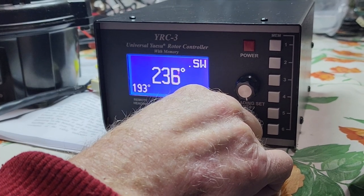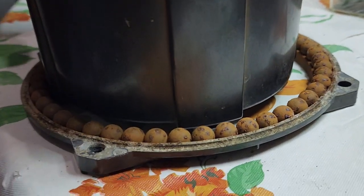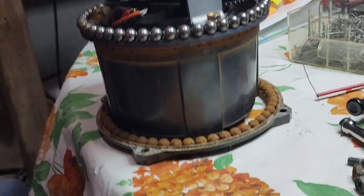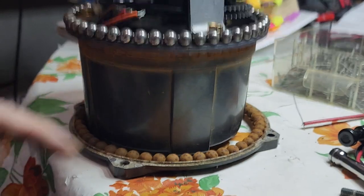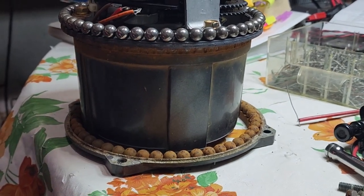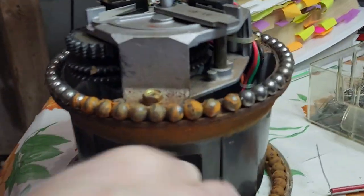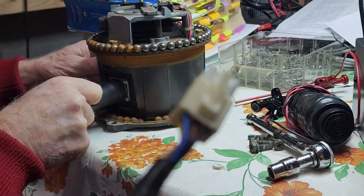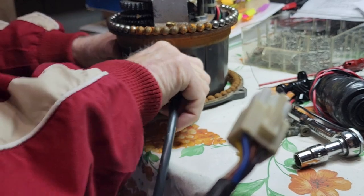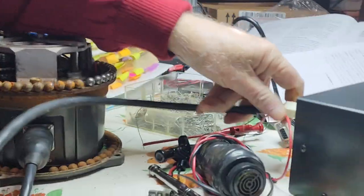What we hadn't connected is that this controller works with both AC and DC rotors. The G800s are DC rotors, and the G450 on his tower is an AC rotor — and the controller comes out of the box ready to work with an AC rotor. We opened up the more weathered rotor and found definite corrosion and rust on the bottom set of bearings because the rotor wasn't stored correctly. With the housing removed, there's nothing to prevent the rotor from moving mechanically, but we still didn't realize the controller was set up for AC, not DC.